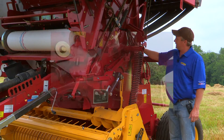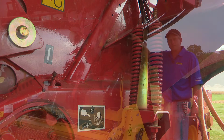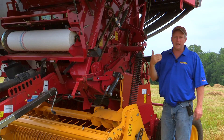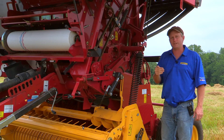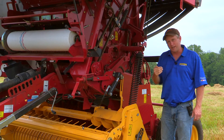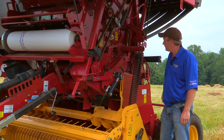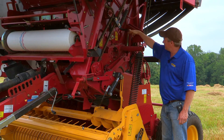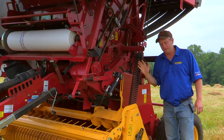If you look closely back here at the springs, you'll see a zinc-plated piece of metal in between the springs. That is a spring gauge, and what it's for is it saves you from having to get the operator's manual to adjust the springs to the proper tension to maximize chain life. All I've got to do, if I have my little 6-inch crescent wrench on my hip, is take and adjust the springs, keep them level with the top of the spring gauge, and I get consistent life out of the chains.